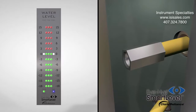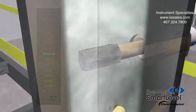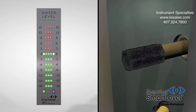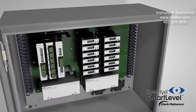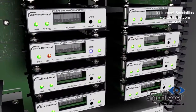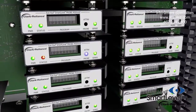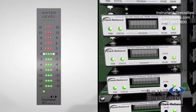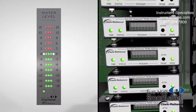The blue light alerts the operator to conduct a blowdown on the ElectroLev column in an effort to steam clean the probes. If this procedure is successful, the blue light will go out because the probe life has been renewed. If the blue light remains on after the blowdown procedure, the operator goes to the control unit to identify which probe needs to be replaced, as it is no longer dependable. The operator will observe a blue light on the level detection module corresponding to the probe in need of replacement. Once the probe is replaced, the blue light will go out and the system returns to normal.